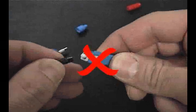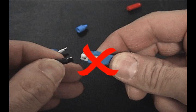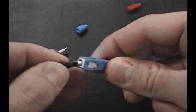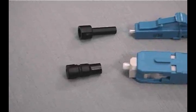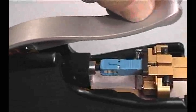Do not remove the front protective cap or replace it with an alternate style cap, as this cap is sized specifically for proper operation of the Accelerate crimp tool. Also note that these caps should not be reused after one termination cycle, since the caps can deform slightly with each cycle and will result in increasingly higher attenuation.